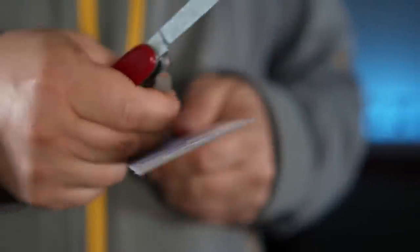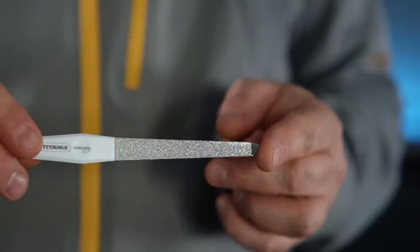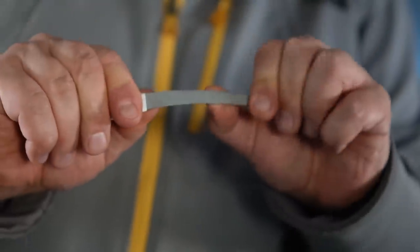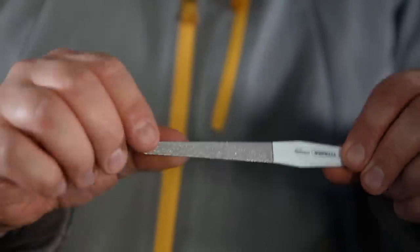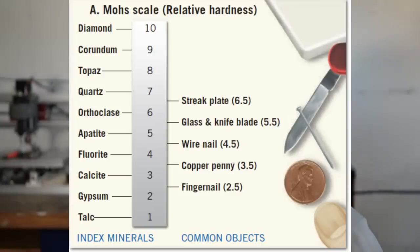After many knives I wanted to know more — what exactly is this, and why does it work so well? So I contacted companies who make sapphire nail files and they all told me the same thing. Basically, these sapphire nail files consist of corundum particles embedded in a nickel matrix. The base material is spring steel because the nail files have to be flexible, and at the end the file is chrome plated so it doesn't oxidize. This is actually pretty much the same as a diamond file — on a diamond file there are diamond particles in the nickel matrix, but here there are much cheaper corundum particles. On the Mohs hardness scale, corundum has the value 9, diamond has 10, and silicon carbide has 9.5.